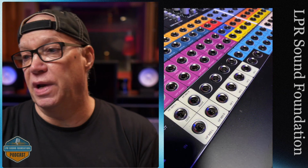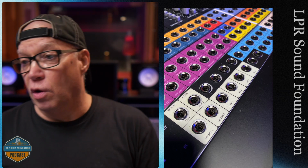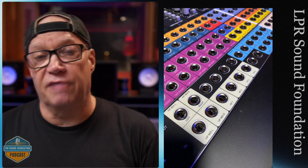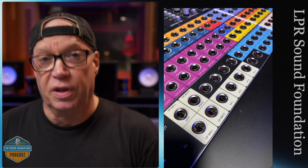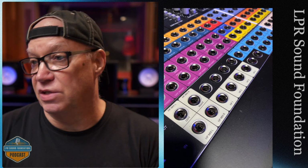Now, the headphone distribution system we use in here is the Furman. Really simple. Got 4 inputs. Let's see if I got the other one. Yeah, I've got 1, 2, 3, 4 submixes I could send, and they're actually on the patch bay. Here they are on the patch bay. You can see my patch bay is labeled HP mix left and right. Those are fully normaled into the mix left and right on the Furman, which is just the stereo input. And then I've got the submixes that I could send.